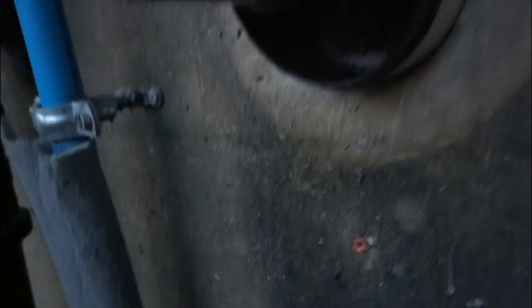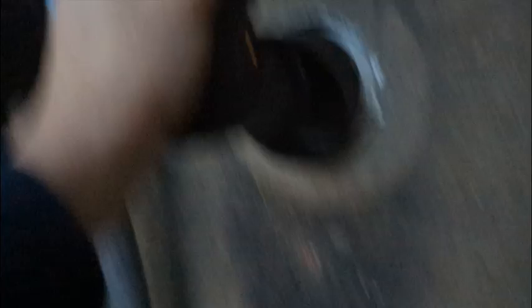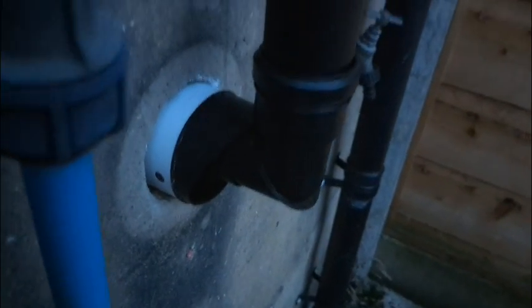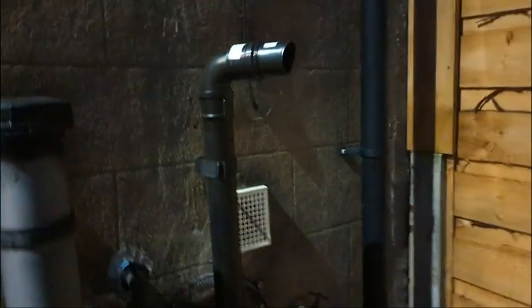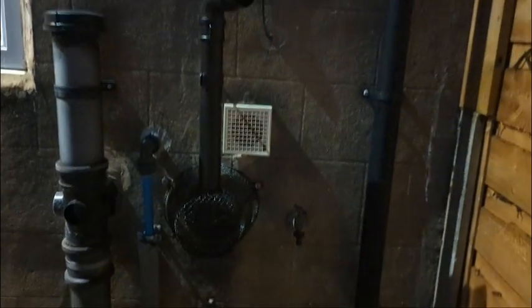The customer wants a plume kit. If you don't know how to do this - you pull that nose out, which has got an O-ring on it, and then the plume kit just pushes into it. Again, if you're fitting a plume kit it has to be one of the rigid flues that you cut to size, not a telescopic one. We're all in - cage on. I've had to cut a hole in the cage and bolt the bracket to the wall.